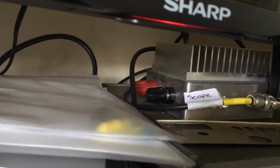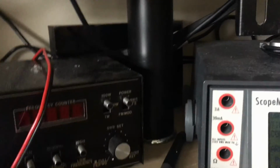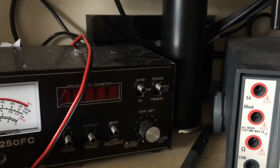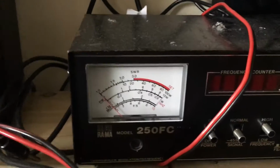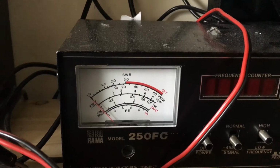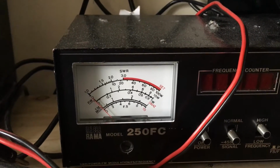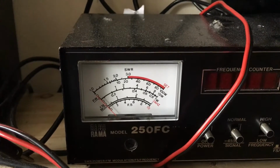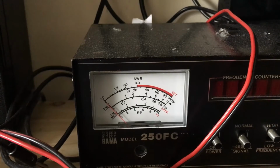So what we've been doing, here's our little voltage takeoff there, dialing the radio into a known voltage for a specific amount of watts, say 10 watts, 8 watts in some cases, setting this to the 10 watt position and checking it, and setting it to the 100 watt position and checking it, and it's not too bad on the 100 watt scale. The 10 watt scale is kind of shady,